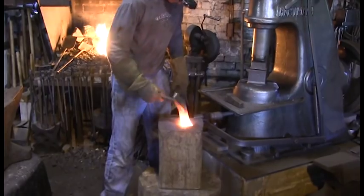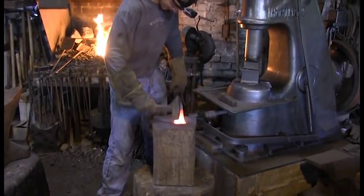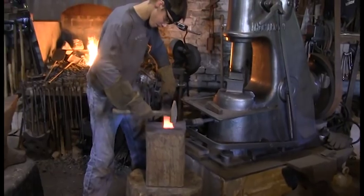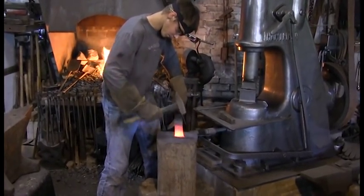Carter starts off focused on his idea of hitting the very edge of the piece. This is not such a bad idea. He is hitting exactly where he wants to, but now the hammer swing is totally crippled. The part is getting cold and the baby blows are getting nowhere. In desperation, he cranks up the tempo.